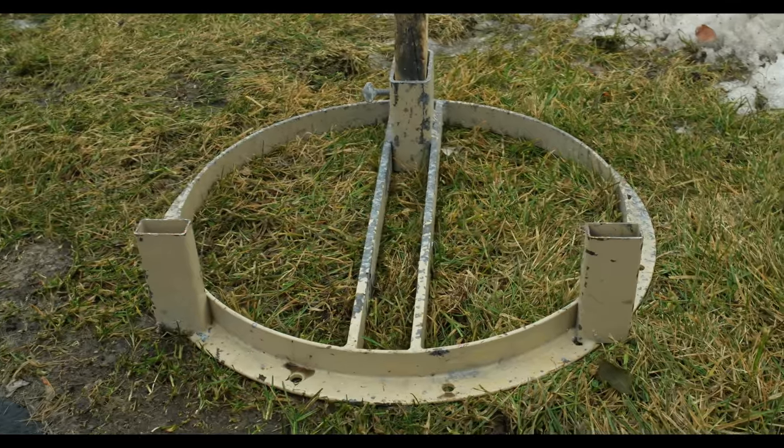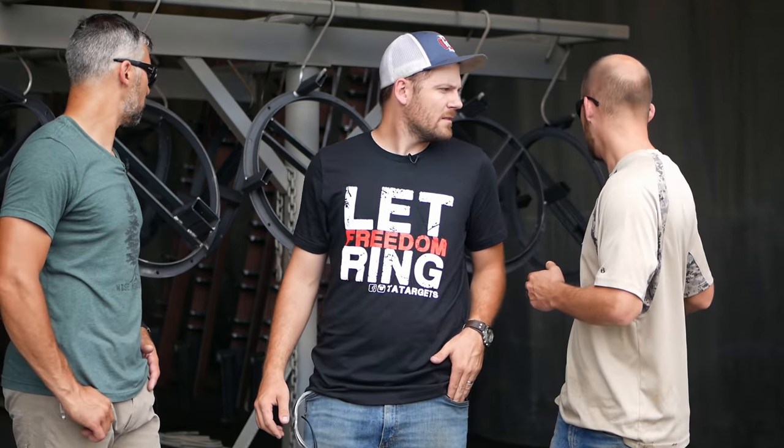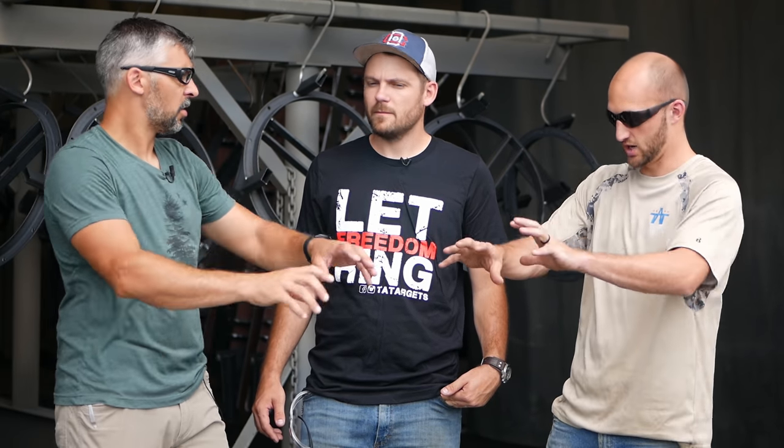And what kind of paint is it? It's direct to metal paint. It's similar to automotive grade paint, but it's direct to metal. So it's like something you paint a tractor with or something. Yeah, more or less. But tell them what's unique about how we spray it. With the system we use, we actually ground out our carts, and we have an electrostatic gun. It positively charges the paint. And then when we spray, the paint is magnetically attracted to the base itself. So kind of a powder coating process? It's not powder coat. It's not heat. It's just like polarization, negative, positive.